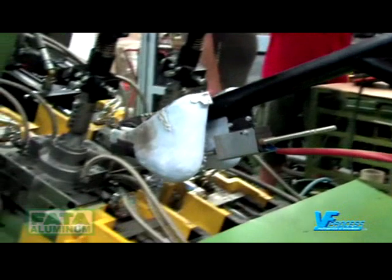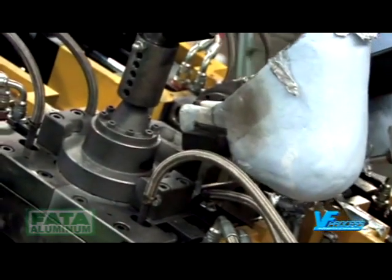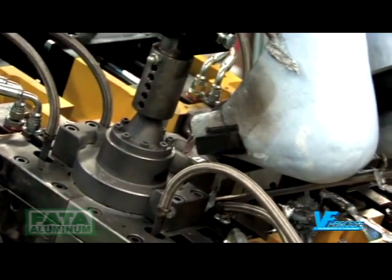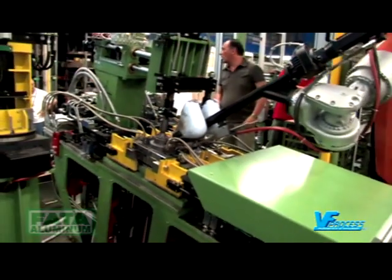The robot, low on the bench, begins pouring. Via an encoder, the bench instantly transmits its position to the robot to allow the correct follow-on during the seesaw movement of the bench, guaranteeing a pouring with a constant flow into the channels of the moulds.